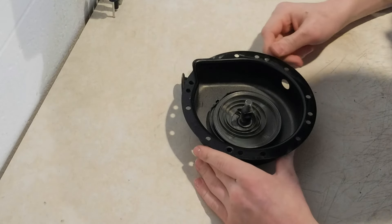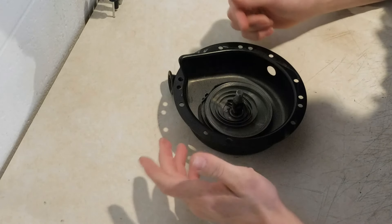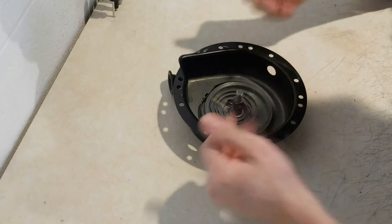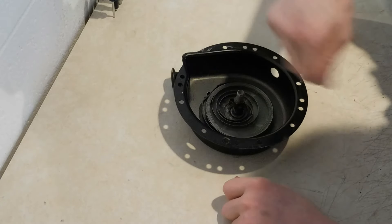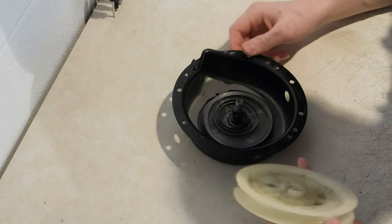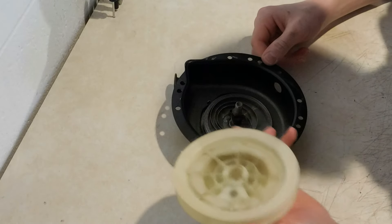Another trick to winding a spring is to have a board with two nails in it, then you grab the end of the spring and put a board in between the two nails to keep the spring from coming up, then you grab the end of the spring and wind it around and around, and then transfer it over to the case with the pliers, just like I did there. But I like this little tool — it works pretty good. If you want one, let me know and I'm going to be able to send you one.